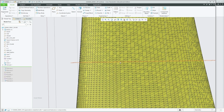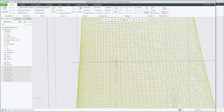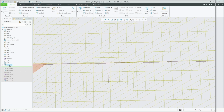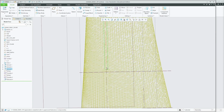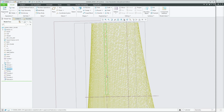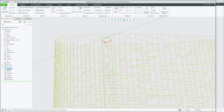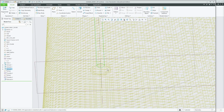You can't see this inside the blade, so I'm going to turn this to a wireframe view. Even then, it's kind of hard. But there are some features on the inside of here. This extrusion that's right here is where I embed a washer. And on top of that, this cutout is where the head of the screw that goes into the inside of the carbon fiber spar goes. And then I think there is a hole that goes all the way out to the tip of the blade that I use for putting an Allen wrench down inside to hold this screw. It also has a double function in that I can screw a screw into the end of this hole to balance the blades. So let's put those three features in now.